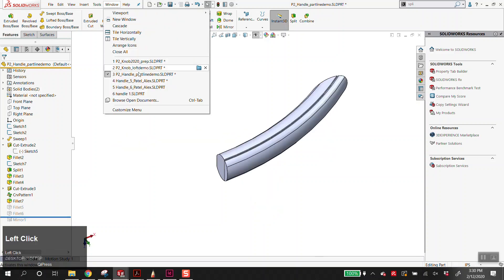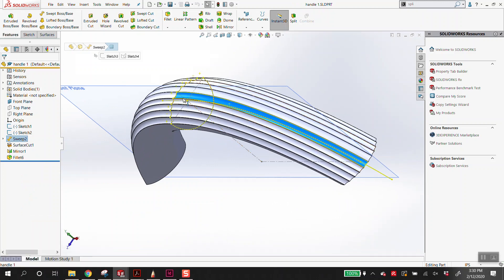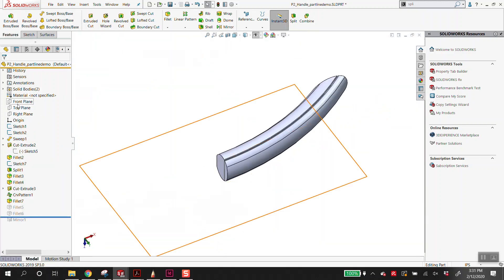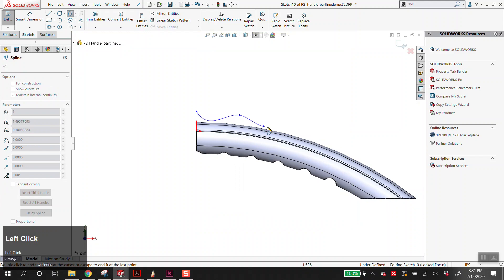The goal is to get these to wave in and out. To get that as a pattern in SolidWorks without surfacing is really hard, unfortunately. Surfacing would be your best bet. Roughly, one thing you could do is use a spline — by having a line that kind of dives in and out like this along the front face. If you sweep cut a circle along here, it should give you the effect you want. I just don't know the best way to set this up in a controlled environment — it would probably best be done by copying the master sketch and offsetting it.